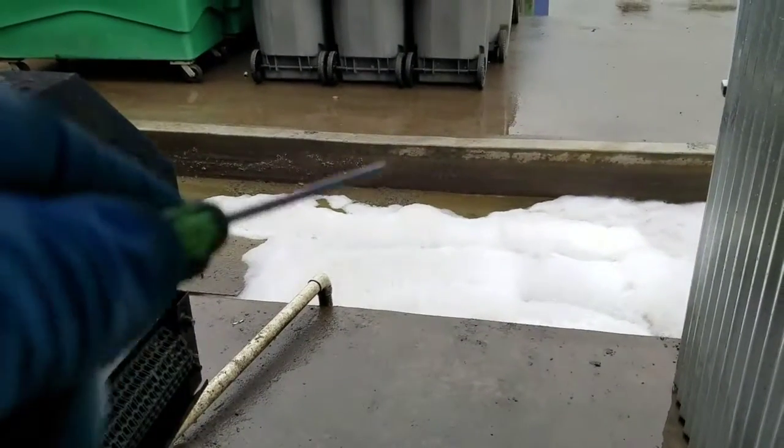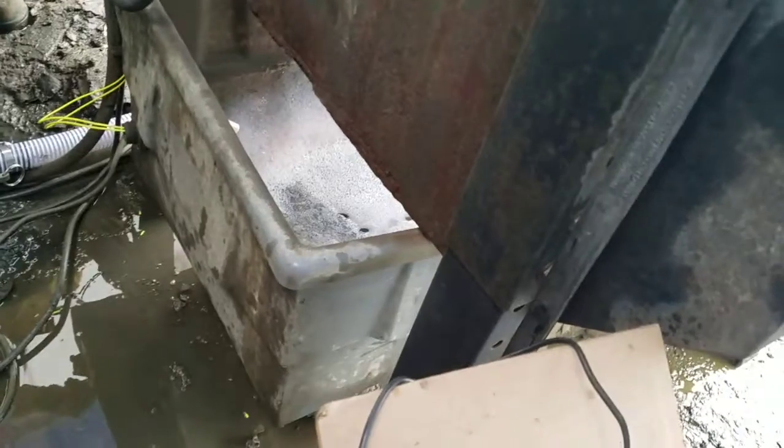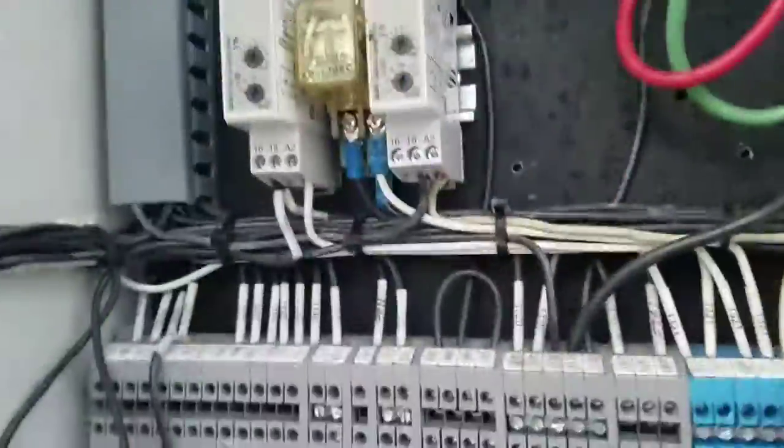So this system picks the water up from the pit, pumps it in through this paper thing, and it falls through the paper into that tub. And in the tub, there's a float — you can see the yellow wires there. The problem is the water gets slapping around, and the float turns the pump on and off — click, click, click, click.